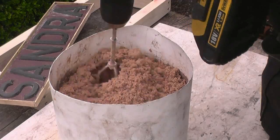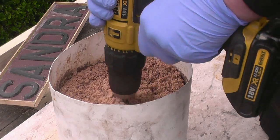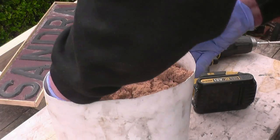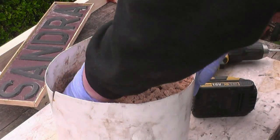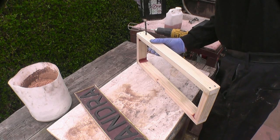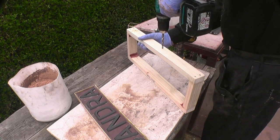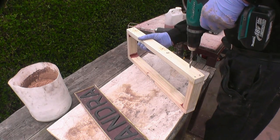The sand has now become nice and fluffy and aerated. I must make sure I get Deb's mixer cleaned up before she gets home from work. Here I'm drilling holes into the inner core box — through these holes I'm going to put a plastic line and that's where I'm going to inject the carbon dioxide.